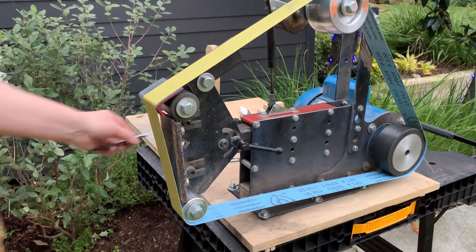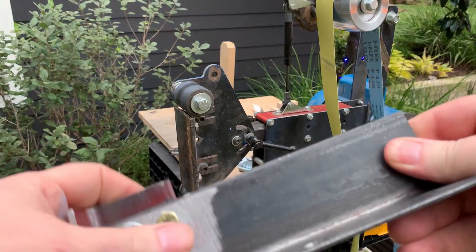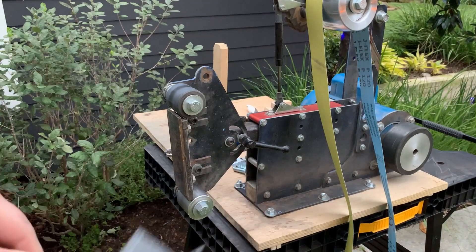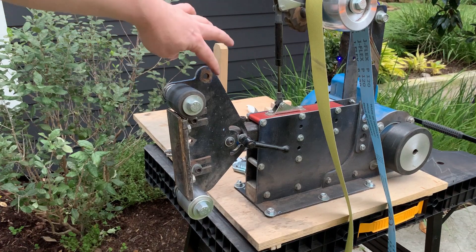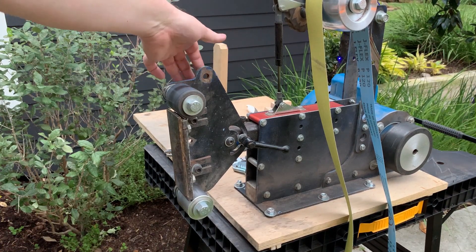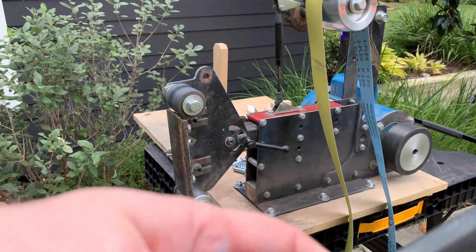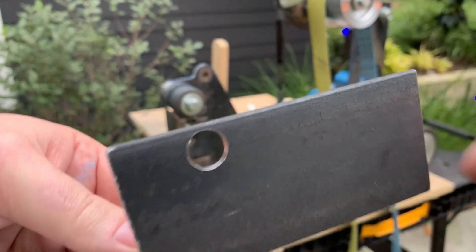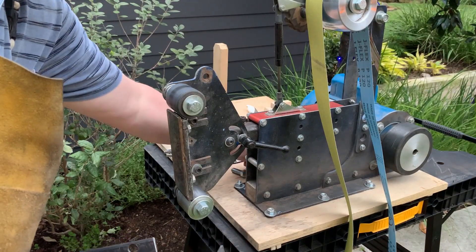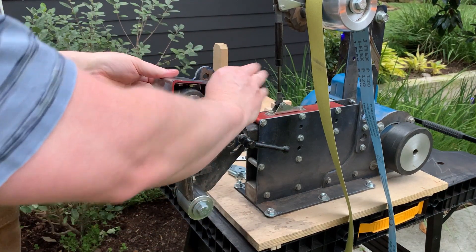Let me show you how I made it. Since I can't weld, all I did is take a piece of angle iron like this and put this hole here. Everybody's grinder is a little bit different — I got mine from Wilmont Grinders, and it has a threaded hole right here, that's a half-inch bolt. So I made a half-inch hole right there to bolt it on with, and I used a bunch of washers for spacers to get it at the right spacing.